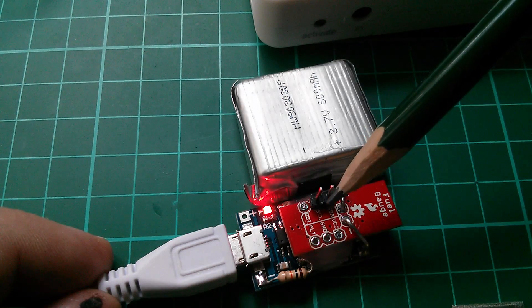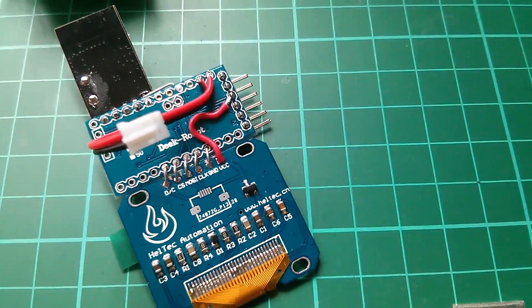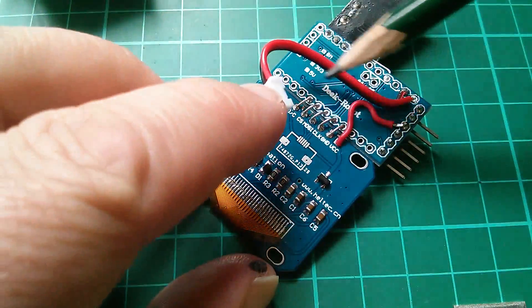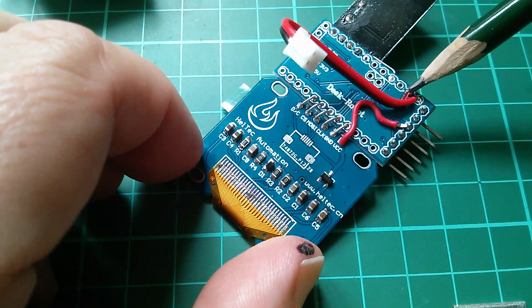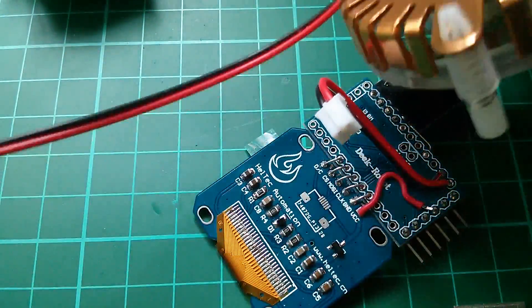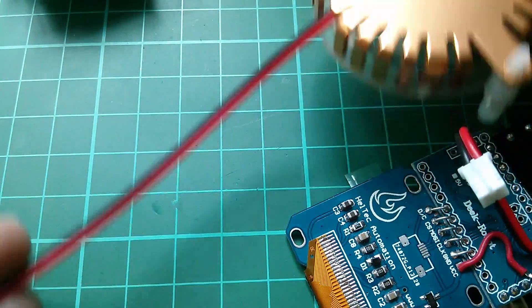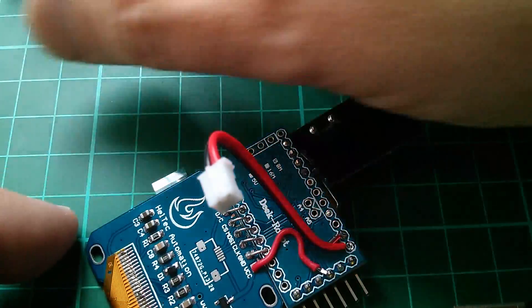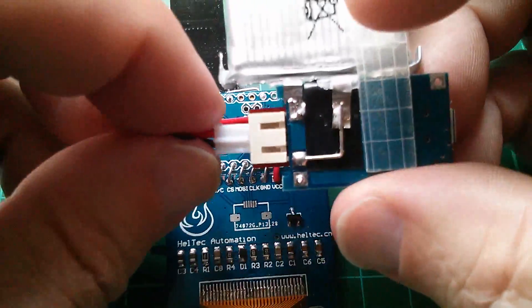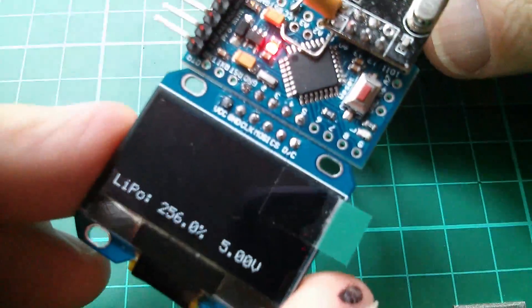That's charging up. Now I need to check whether this LiPo powers the wearable. So on the back of the wearable, I've connected this connector — I've cut it down short so that it just fits onto raw and ground. Now this wire with the connector actually came from one of these VGA fans, which I used recently to mount a 10-watt LED. I'll just cut the wire off — it happens to be the right size, so that fits very nicely. So now the next thing is to plug that into my LiPo pack, like so, and then check that this is functioning — which it is.